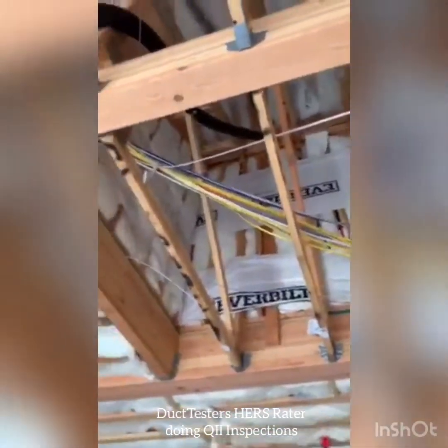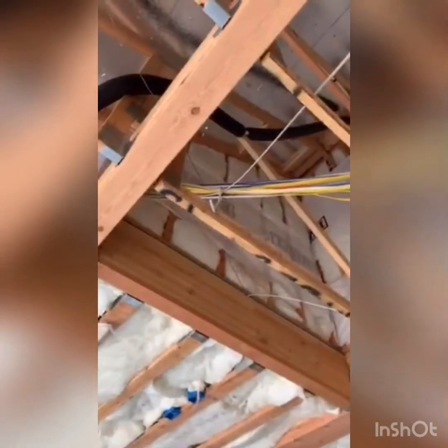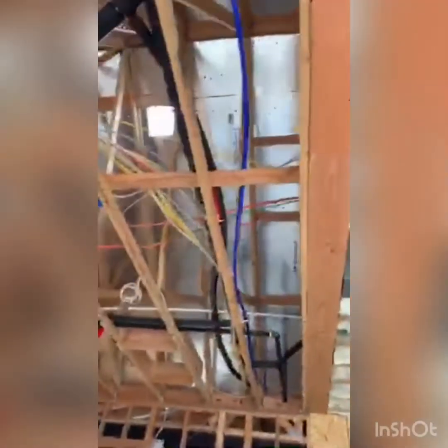The walls here above the garage — they have to be fully covered. See that tie deck right there? It has to be completely covered with insulation, all the way around here. You can see it's not like an unsolid air barrier.